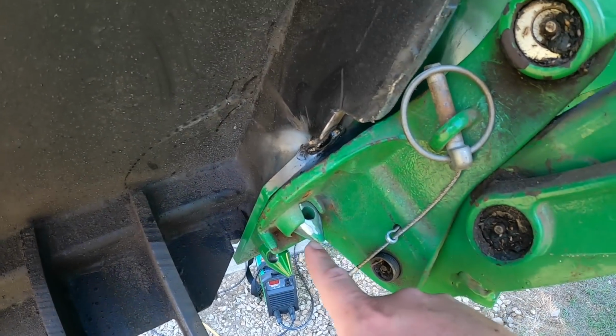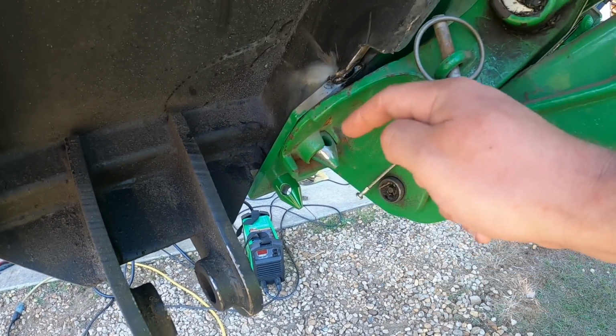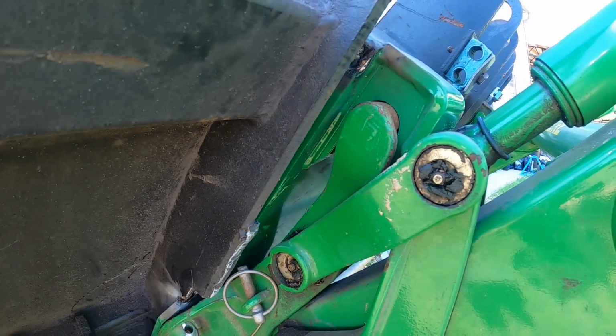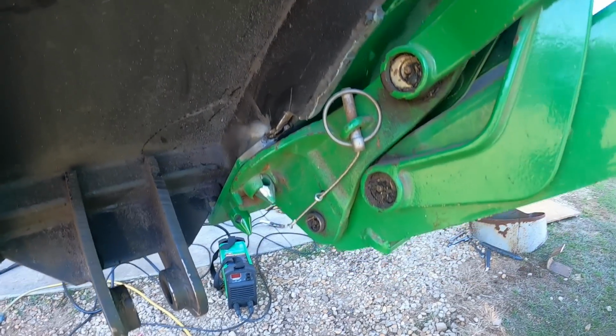So I had to grind a ton off the top of these pins to get them to fit in the hole. There's a whole bunch of slop in the bottom. These pins need to be down about 1/4 of an inch, it looks like. So I'll put in the description of these brackets a big disclaimer: do not buy these. Go with a different brand.